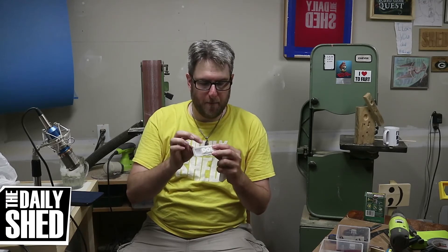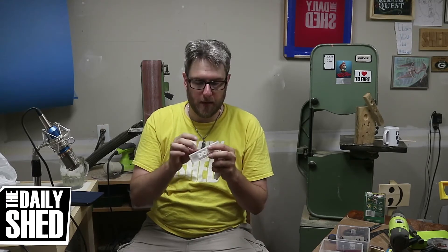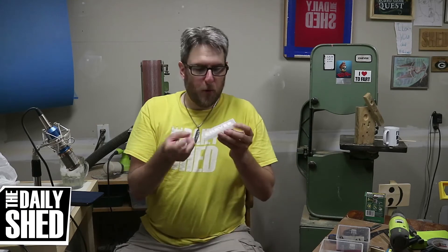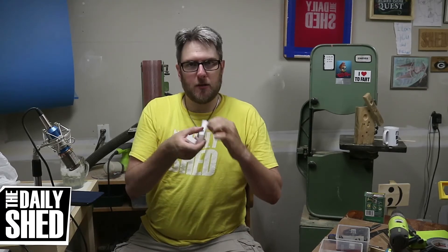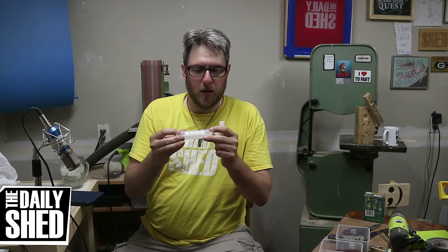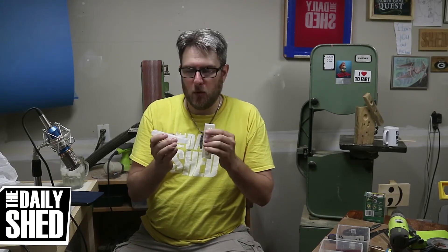These molds might also be too thick. I'm worried about the ridge lines. I'm printing at the highest definition my printer will print, so the layer definition isn't super noticeable, but when you're casting something in a solid material, every one of those little ridges is going to make it way harder to get the material out. These molds might be one-use and then I have to break them out. I made these with one-millimeter walls — they might be too thick for throwaway molds.